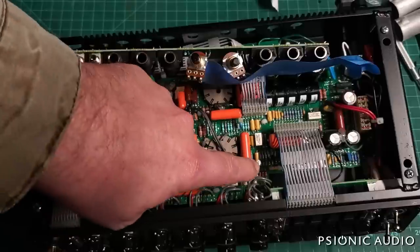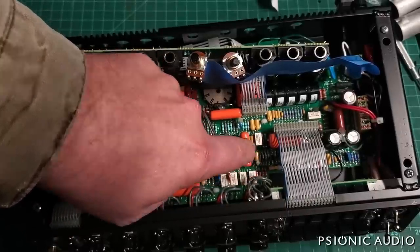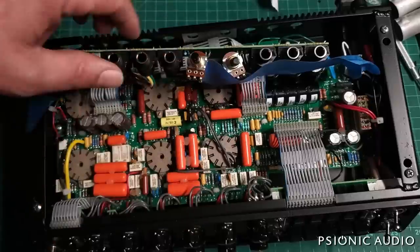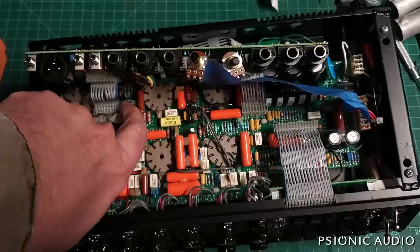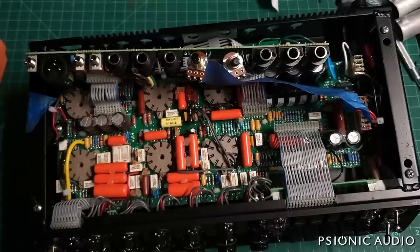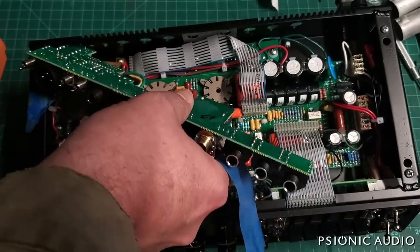Not to get sidetracked, this transistor measures wrong. I've got a bag of 174s around, I can do that. But I wanted to get the amp working, plugged into the effects return, and just deal with that. At that point, I could hear things in the output. So this was affecting things. This was muting things that should not be muted, to some degree. At that point, I could hear some things. They're a little bit louder.